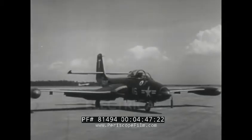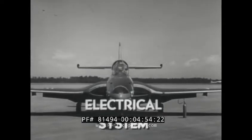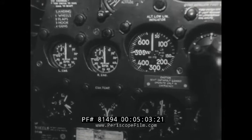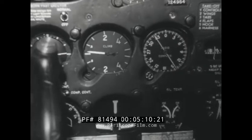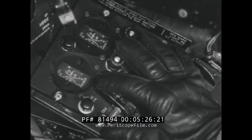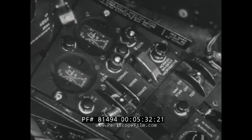The airplane is equipped with a 24 volt DC single wire electrical system powered by one 24 volt 34 ampere hour battery and two 28 volt 300 ampere engine driven generators. Direct current power distribution is divided on three buses. The primary bus supplies DC power for equipment essential to safe flight and operates the inverter to power the AC flight instruments. With the battery generator switch in battery generator position and both generators inoperative, the primary bus only is energized. With both generators out, placing the electric power switch in battery only position will for a short time energize the secondary bus to power other equipment.